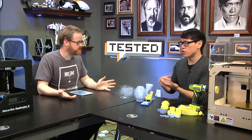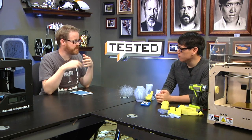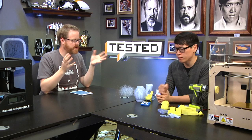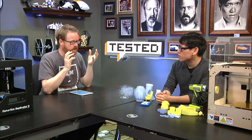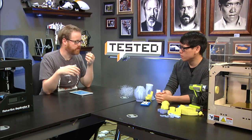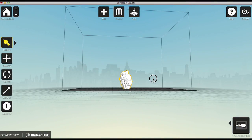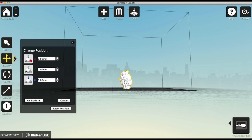Okay, so that pretty much covers the hardware side of a MakerBot. And I mean, there's electronics and stuff like that that makes all the controller stuff run. There is a controller inside, which has an SD card reader. And basically, the way these machines work is you take a 3D model, typically an STL file or an OBJ file, or you can use most 3D CAD packages to render out one of those two formats. And these are standard formats.